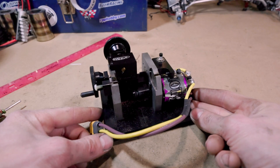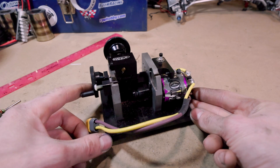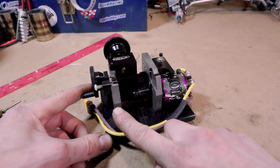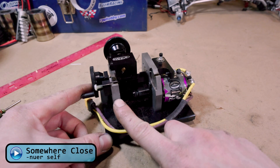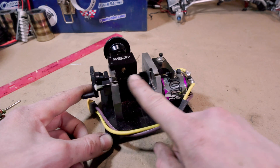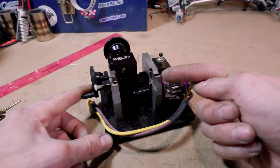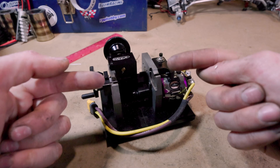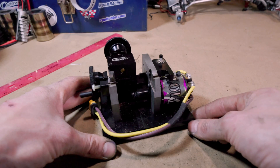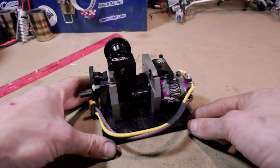Speaking of parallelism, I want to go check this in the milling machine, grab my dial indicator, and see how parallel the two inserts are right now — get a baseline for where they're at, along with where the gaps for the motor shaft are and how in line with each other they are. Then when I'm done, I can come back, look at my baseline numbers, see how well I did, and tweak it if it needs to be tweaked.